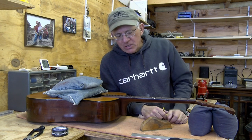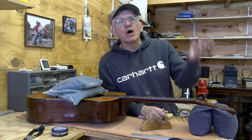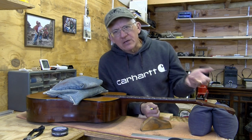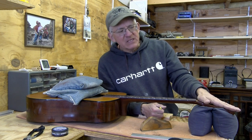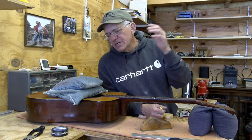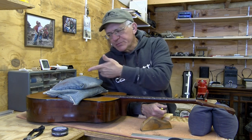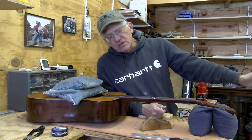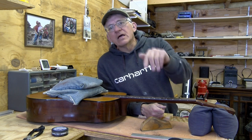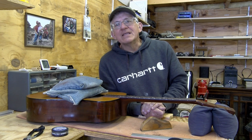So there we go. After I finish this up, watch for a video where I play this guitar and evaluate it after everything's done. This is a 70s Martin getting everything done to it - tuners, frets, neck reset, scallop, popsicle brace, bridge plate. The bridge plate's already out on this one, bridge is off. It's getting the full 70s overhaul. It's going to be in a video and I will recheck the neck relief then, and we can all see how I did. That's how I deal with neck relief on a non-adjustable truss rod.